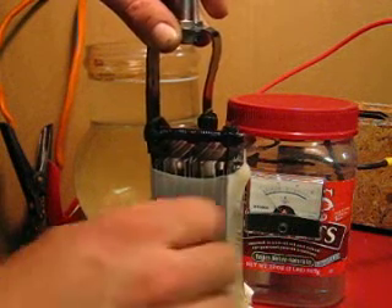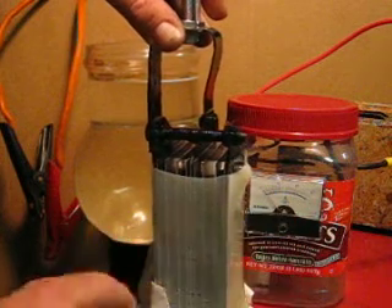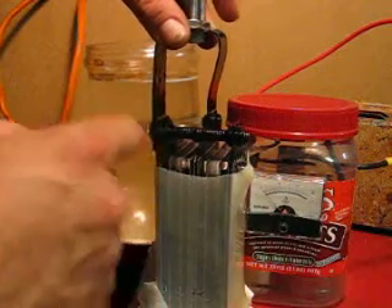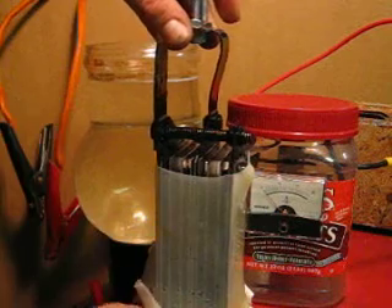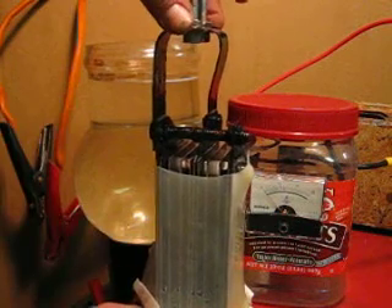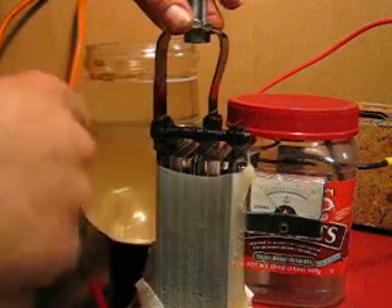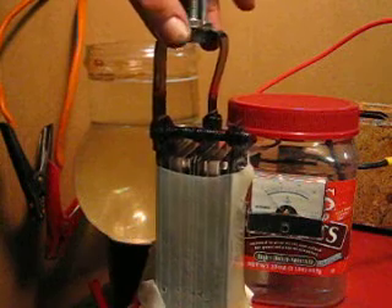It's wrapped in heat shrink to keep the voltage from being lost in the water around the cell — you want as much current to stay in the cell as possible. I've put liquid electrical tape on anything that's not in the cell, so when it's submerged in the water, you don't lose voltage from the all-thread or anything else that's going to be in the water.